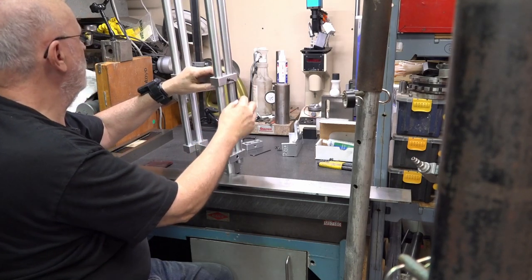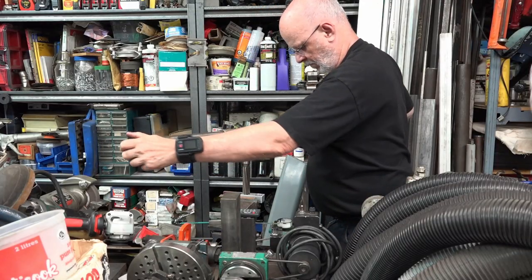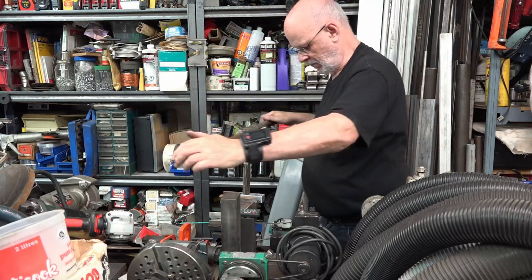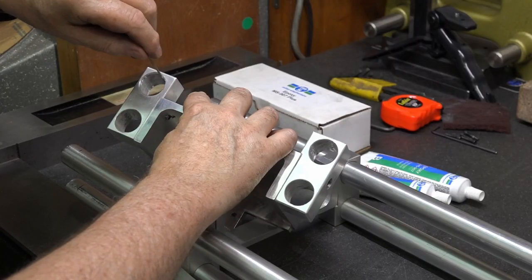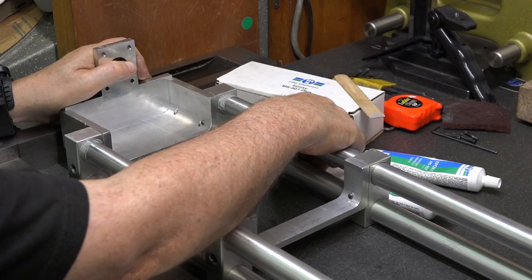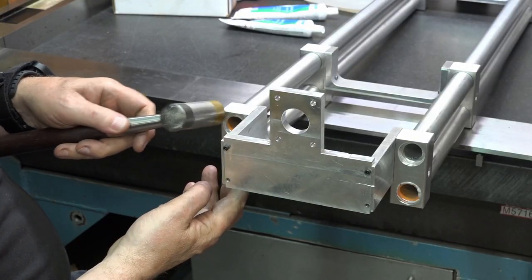No mistake was possible, as most of the parts were to be fixed with industrial-strength epoxy glue. A little more tolerance than what was designed was required in order to allow room for the epoxy in the joint. A big one-inch reamer was used to make those fine tunings. Then for the final step of the mount, there is a combination of screw and epoxy to hold everything together. Using clamps, the big square, and the granite table to hold all the parts square until the epoxy glue cures.